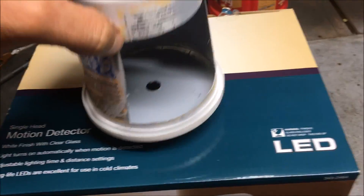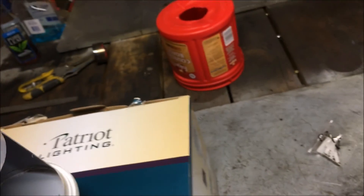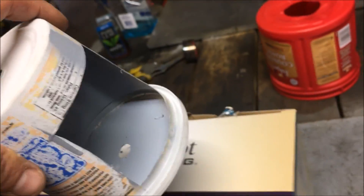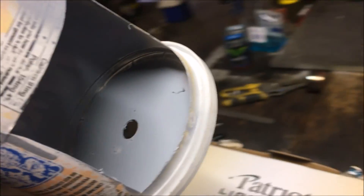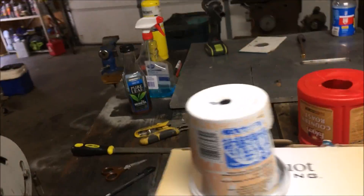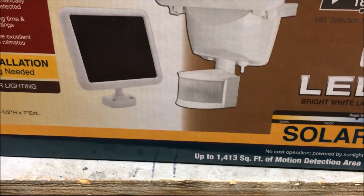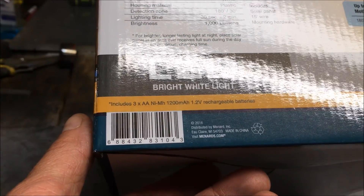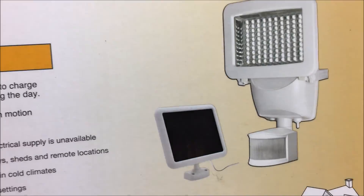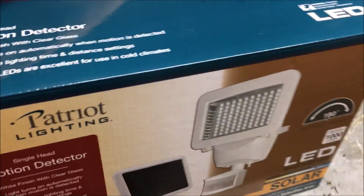I'll check into the numbers and give you guys a bit more specifics. In my opinion, this is the best way to go — there's no need to do a bunch of math. This right here proves you're at the right angle, so position it, line it up, read the angle on your solar panel if you're lucky enough to have one with a dial indicator, then aim it south — that ought to do it. I'm also going to be doing a review on this product in the next video. If you have one and have used it, leave a comment about what you think. I'm under the impression this is a Chinese knockoff — good idea, but the hardware they provide just doesn't cut it.